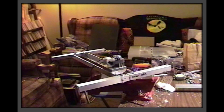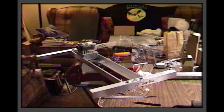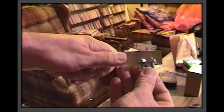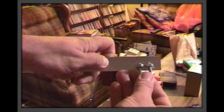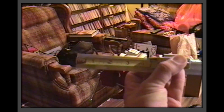Here is the finished main unit frame. You will add the adjustable front arms in an upcoming step. The U-bolt needs to be placed starting about a half inch back from the end of the crank bar. This is the most critical drilling step so be careful marking the centers for the holes. You may wish to use a drill bit one step larger than the U-bolt's quarter inch diameter for ease of attachment.